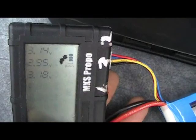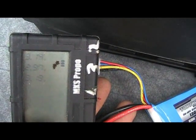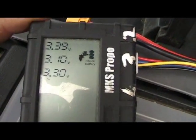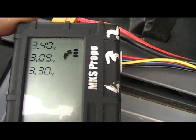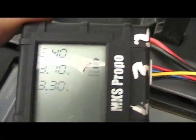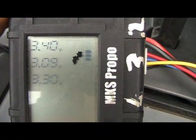This one's showing the same again — the middle cell seems to have dropped a lot more than the other two. This is just ridiculous. Now, this is the first battery I flew with, where that center cell was reading 2.75 or something. As the battery's cooling, you can see the voltage climbing back up again. I'm guessing, if the center number there corresponds to it being the center cell, it could be that just the center cell gets hotter than the other two because there's no air flowing over it. I'm not sure why that center cell in both of them is reading so much lower than the other two. But as you can see, as it's cooling, the voltage has climbed and it looks like that's probably whereabouts it's going to sit.